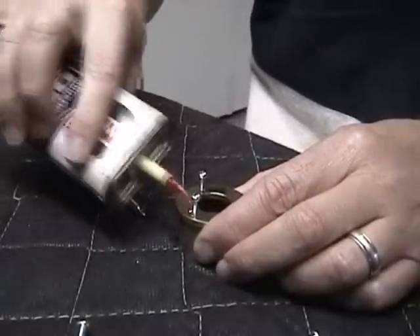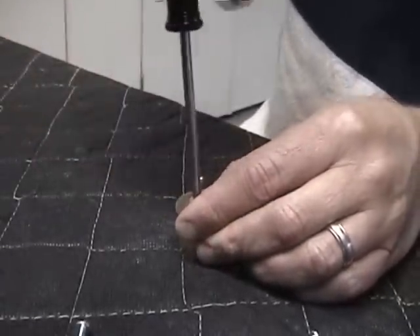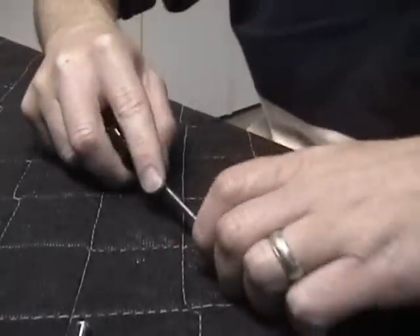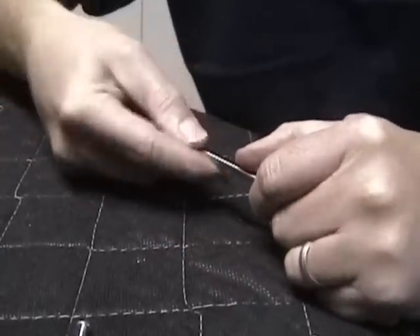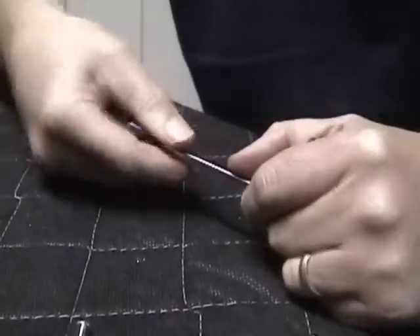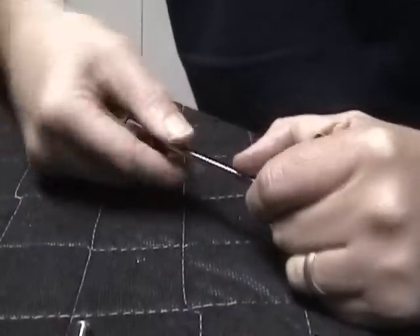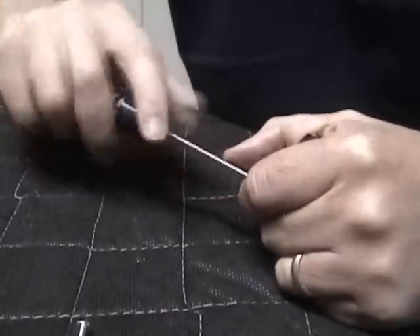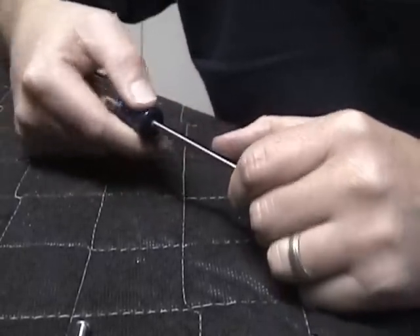Put a little bit of oil on this. Start it — putting constant pressure on the screw as I'm screwing it down. I'm tapping the holes, giving the holes threads. Now I'm going to unscrew this.